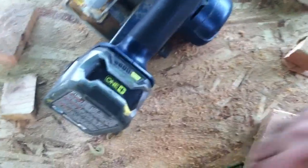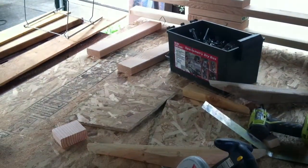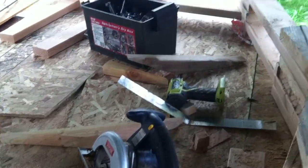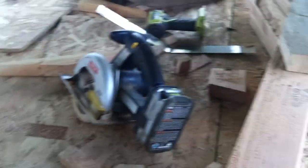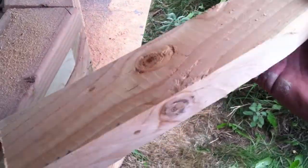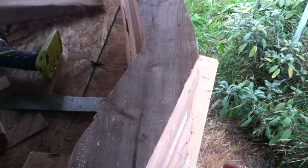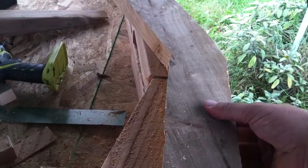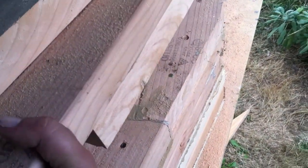It's all screwed and glued to the board, and then I have another piece going across to cover up this line and provide some reinforcement. Once I have those, I make two of them and those become the ends of the roof. I also have to make the other framing pieces. I end up with a weak link at the peak, so I make what I call boomerangs — basically what would serve as a gusset on a truss. I'm taking two-by-six, cutting it down, and making these. Each truss gets two of them, glued and screwed or glued and nailed.